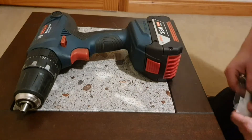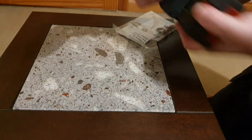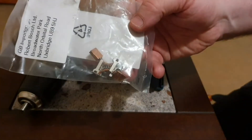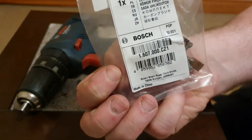If your brush drill does something like that — stops going right or whatever — the first thing you do is change the brushes, or at least inspect the brushes. I've taken the liberty of ordering the brushes for this thing; you can see the part number right there.